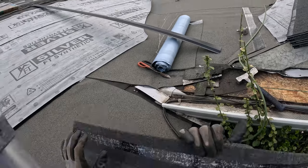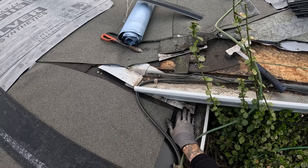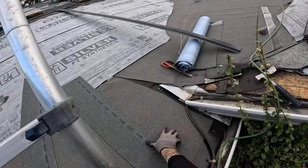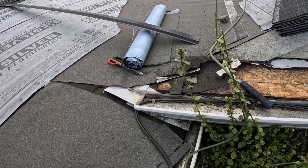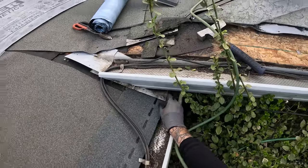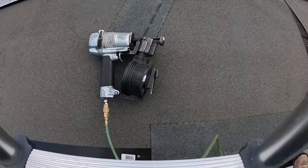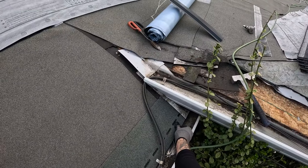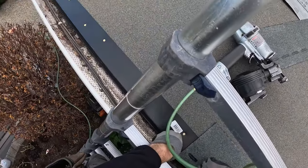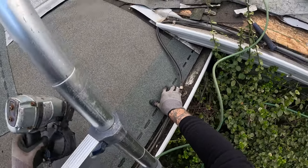You always land your step on your starter. So metal under the metal, then starter under the first piece. Your shingle will cover that. You always need to have a shingle under your starting piece of drip or flashing. This metal always lands on this. So I'll get this up in there and set my nice little overhang. Of course there's cables here which are just here to make me mad. Starters are nailed within four inches — I believe of the eave, or three — somewhere in there. You can always check your keyways here to see how tight things are.